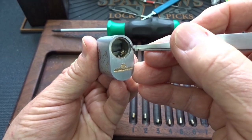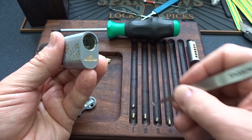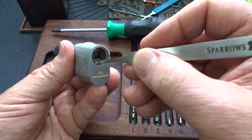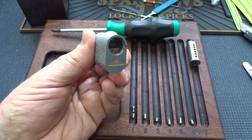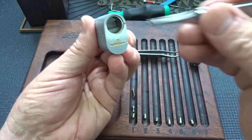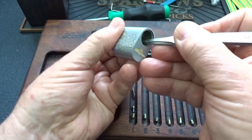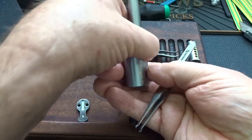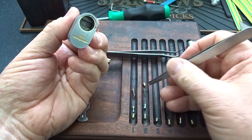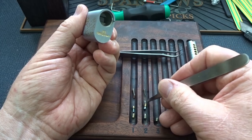There's our T-pin — he's more than a T-pin. He was a pin-and-pin. We have a little steel piece that goes right up inside of there just like that. Very nice. Let me get those fine tweezers so I can grab these guys, because I'm pretty sure we're going to see some variation in spring — there's a double spring in one. Number two: kind of a weak spring. Another homemade pin-and-pin — he was in like that, with a tiny little spring in that dude. He was also hollow, fitting in there just like a little nail head.